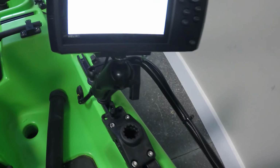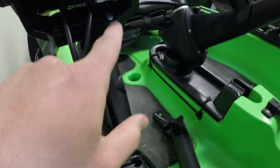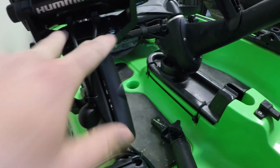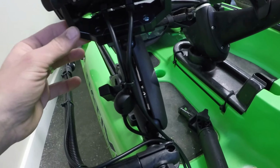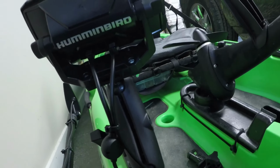So basically, the material list that I gave earlier at the beginning of the video showed all the different components, and I can list it all out. The only thing that I did not have was these bolts, which I had to come up with. I just put two. There's spacing for four different holes here, but I just did two because that's all that's necessary. You might want to do four, but it's completely secure. I put washers and also a split lock washer there to keep it from possibly backing out.